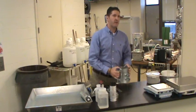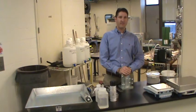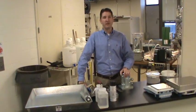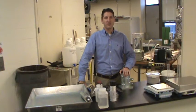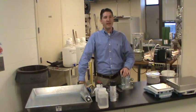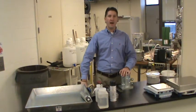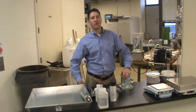Lab number three is the modified Proctor test. These lab procedure instructions outline the method for conducting the modified Proctor test. Test data from the Proctor test can be used to determine the maximum dry density and optimum moisture content of a particular soil. A geotechnical engineer can also use the data from this test to create a specification block for a contractor placing and compacting a structural soil fill. This test will be conducted five times, with each sample having a slightly different moisture content. Use a phase diagram to determine the correct amount of water to be added to the soil for each iteration.